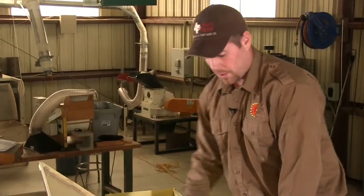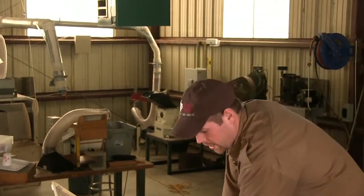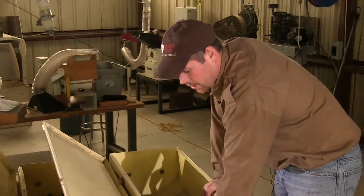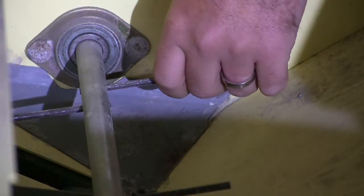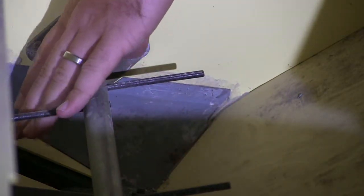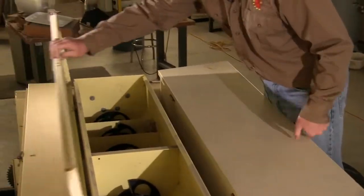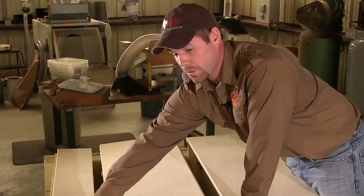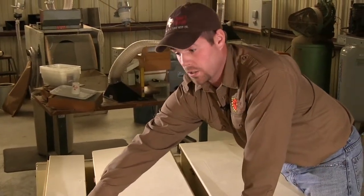The back box is made for harder seed that will flow more easily. It also has agitator wheels to keep the seed centered and moving down into the tubes, which is moved by smaller picker wheels at the bottom of the box. The third box on this native seed drill is set up similarly to the back box but is designed for very small seeds.